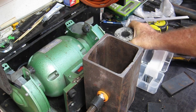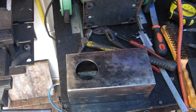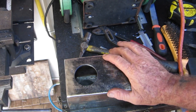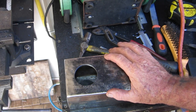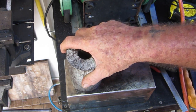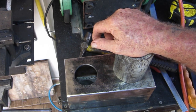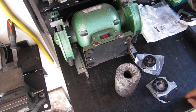I also mentioned I was going to block the end off. These two holes take some chewing out and I'm a little surprised they're not more oversized — it's a 54mm cutter and one's 54.5mm and the other's 55mm, so I'm reasonably happy with that. There's plenty of meat there for bolt holes. To be honest, I feel like a wrung-out sponge today, so I'll have the rest of the day off and get back into this tomorrow. After a good night's sleep I don't feel quite so knackered.